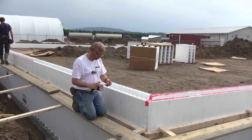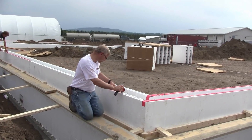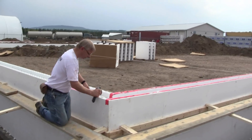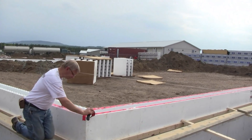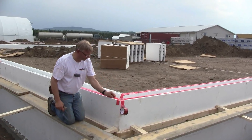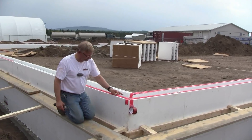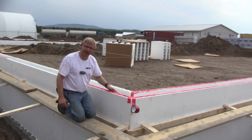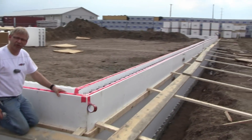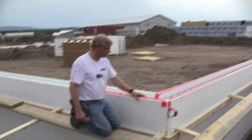Here's how the tuck tape works: I start on one of the projections, make sure it's centered on the tape, and just run it along the wall quickly. Then I follow my fingers along to seal it up so concrete sheds right off. Looking down this wall, it took me about five minutes to do both sides. Now I'm ready to stick in the vertical rebar.